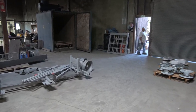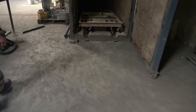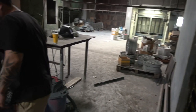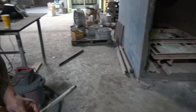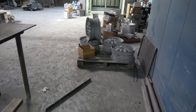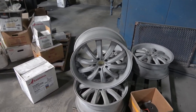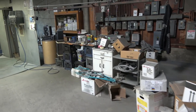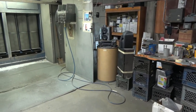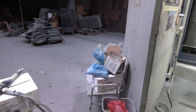For the other ones, the first process is to put them in for the burn-off to get all the paint off. After that process they sandblast them down to the bare metal. Once they sandblast everything down to the bare metal, that's when they take it over to the spray guy — they electrically charge it, the powder sticks to it, then they stick it in the oven. Here's the area where they do all the sandblasting — there's the sandblast gun.